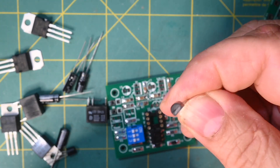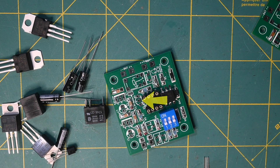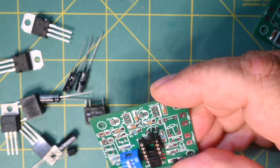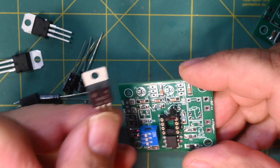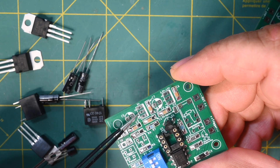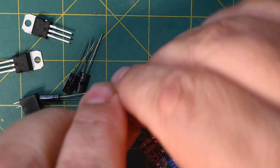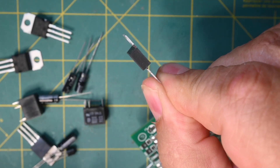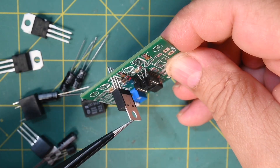Next, we install the transistor — this is a 2N2222. It has a flat spot on one side that corresponds to the flat spot on the board, so just push it in. There are also two different voltage regulators: a 78M05, which is a 5-volt regulator, goes where it's marked '5 volts' on the board, with the thick silkscreen line corresponding to the tab. The other location is marked '3.3 to 12 volts' — if you want, say, a 9-volt output, you could buy a 9-volt regulator, but the construction guide covers that. Install both by matching up the tab orientation.